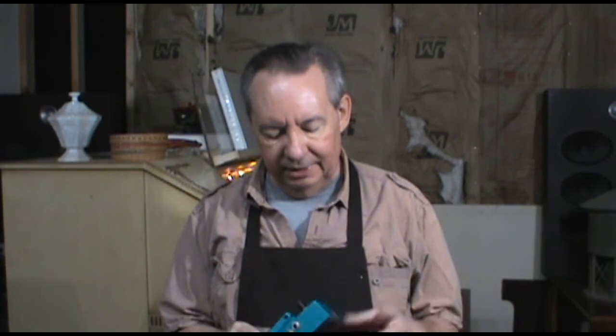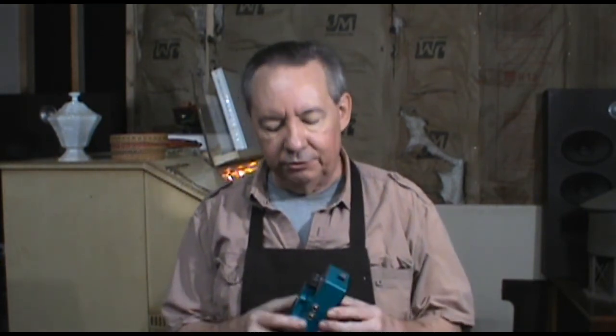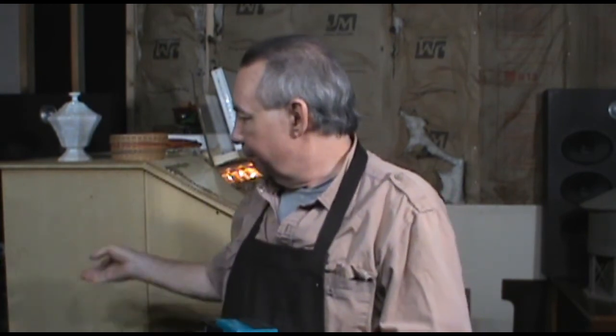The other thing I'm going to do, which will kind of be fun, and I've used these on a number of instruments I've owned, is this pitch shifter. It'll do a bunch of things, but the way I usually set it up is with a mono input and then a stereo output. Now, of course, that piano traps circuit is a mono output, and if we run it through here, we get a stereo output, and then I can put the signal in both sides of the audio and shift the pitch on one side. This gives us a natural chorus effect, and that always serves to make electronic sounds a little more musical.